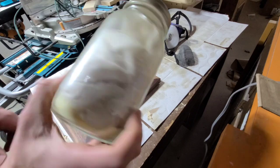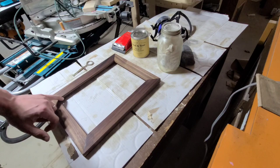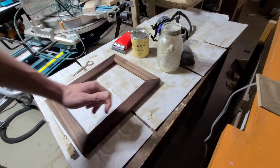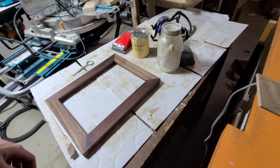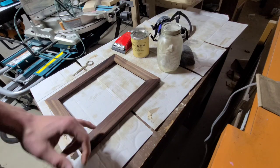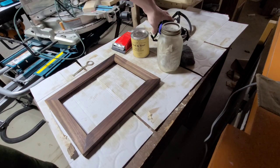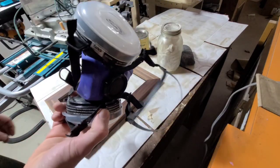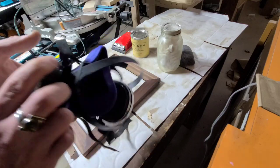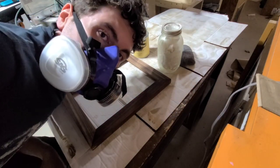It's good to keep an airtight container and you can reuse it over and over again. I'm going to be doing a wet sanding — you can go crazy with this, you can go down to 3,000 grit sandpaper or whatever, but we're just going to do 600 because it's just a picture frame, you're not going to be sleeping on it. Always work in a well-ventilated area, and if you have it, use a good mask. All right, I think we're ready to go.